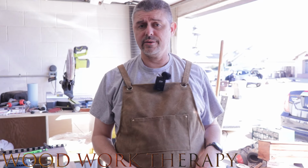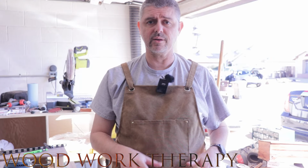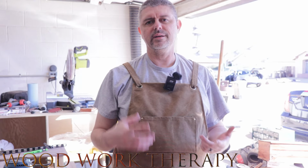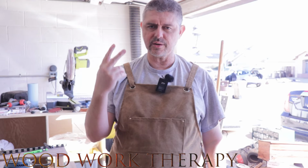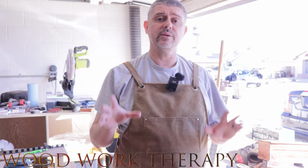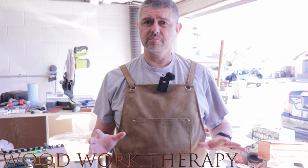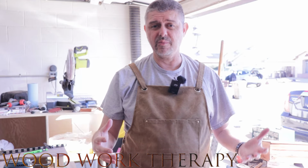Okay, as you saw there, I did several different passes. I went down a little bit, pulled up, went down a little bit, pulled up. The reason for that is we want to make sure we're getting a lot of the chips out of the actual hole, for two reasons. Number one is way more cleanup later on. Number two is that it can bind your auger bit. So make sure you are doing that. That's a great tip, and that'll also reduce some of the kick that you get from the drill while you're drilling. So just something to help you out.